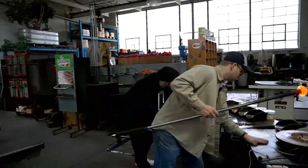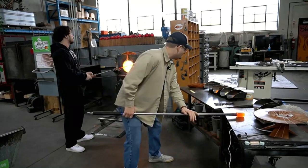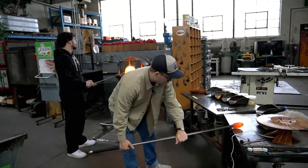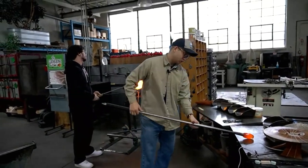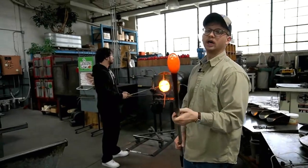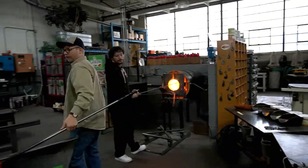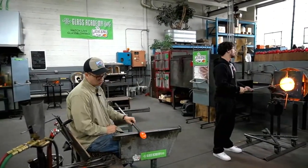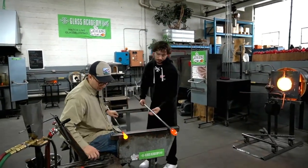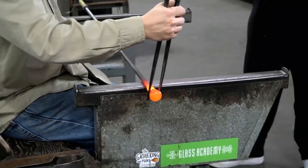Letting it fall back on itself. You want to just ball it up and then I'll put a little neckline in it and we'll be dropping it over top of this bubble. This is how we made a lot of our bar color pumpkins this past year. There's our little bub — I want this to get ice cold, below a thousand degrees cold, because if it's got any motion in it, if it's still warm at all, it's going to disrupt the bubble when I try and squish this guy over it. Red's a really stiff color, so getting it to squish down over the whole thing is going to be a little tough.